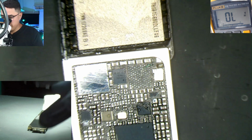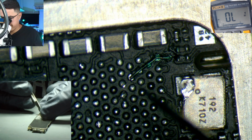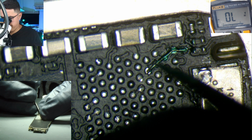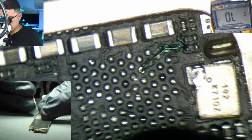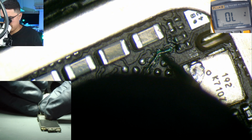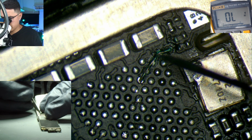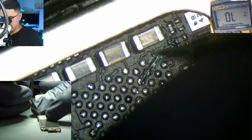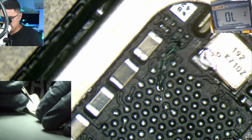All right, so this should be more than enough UV. And I'm just gonna scratch out over the pads and the pad itself. So I need something to solder onto. So that's why I'm scratching out the UV and leaving behind just the areas where I don't need to solder onto so that it holds the jumper in place. All right, so there you have it.